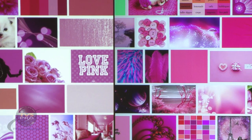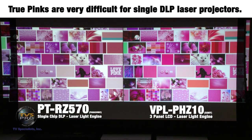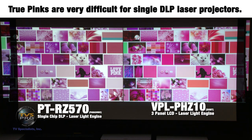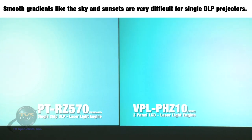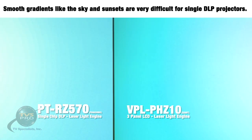This image is one of the most difficult for DLP projectors — most have a very difficult time with pink. This Panasonic does about as good a job as I've seen for a non-three-chip device. Brightness on the two projectors is very comparable in the bright areas, though there's some difference in saturated color. The gradient slide — going from approximately 100 IRE at center out to saturated color in the corners — is one of the most difficult tests for any display device, whether a flat-screen TV, projector, or computer monitor. As expected, you can see a difference between the DLP and the three-chip on this slide, which may or may not matter depending on your application.